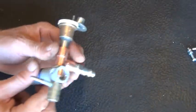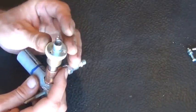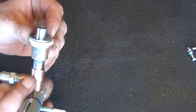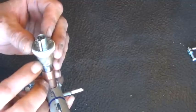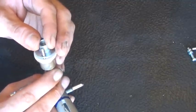The other one's built just slightly different than that one. Let me go ahead and start taking this one apart. You can see here I've got one stud permanently mounted, one threaded stud here at the tip of my finger, permanently mounted out of the brass. That hole got overshot, so I ended up putting a little larger screw through there and using it as a stud in reverse. So let me go ahead and pull that off of there.